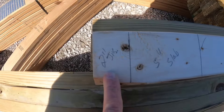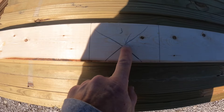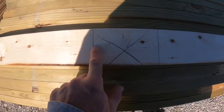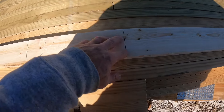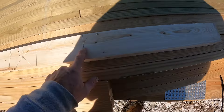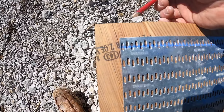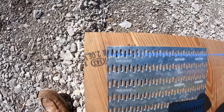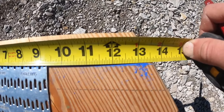Close-up view: two inches of insulation plus five-inch slab gives my finished concrete floor mark. From there to the center of my wainscot board is 37 inches. Pulling two feet on center from the bottom: three-foot mark, five, seven, nine, eleven, thirteen, and then fourteen feet which is my ceiling height — that's where the heel of the truss sits. Now I need the heel height, so I check the truss. My buildings are measured from outside of girt to outside of girt, so the truss sticks an inch and a half outside the column — I mark that inch and a half.